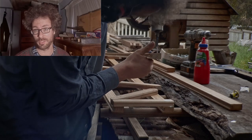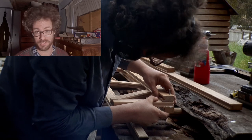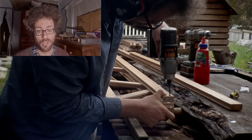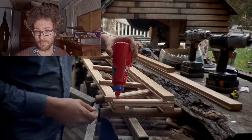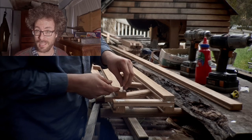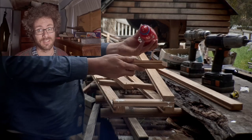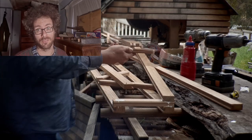Now, if this was a softwood, we could probably get away without pre-drilling, maybe. But because it's hardwood, you have to pre-drill every hole. Not so much because of the holes you're putting through the cords — once you get away from the ends you'd probably be fine — but every piece of the web, you're always going to be putting the hole near the end, and it will split every time if you don't pre-drill.